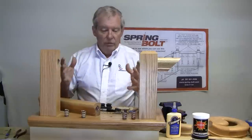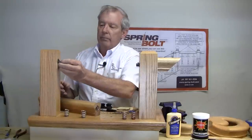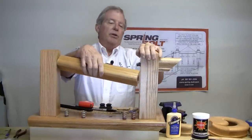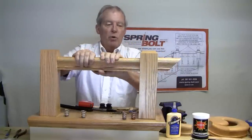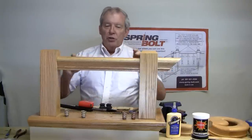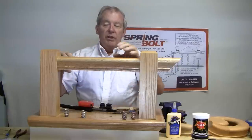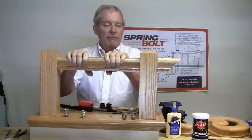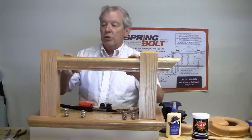After you've accomplished that, I suggest you put it together dry. Insert a guide pin in both ends, get your mill finish spring to your mill finish spring and hook it on your guide pin, push one post or the other apart and just twist it together dry one turn to make sure that everything is tightening up at the same time. Sometimes when you do this you might tighten it up and find one end is tightening up a little bit quicker than the other one.